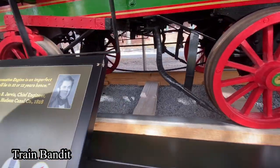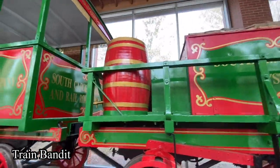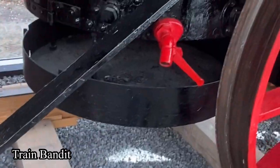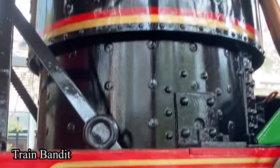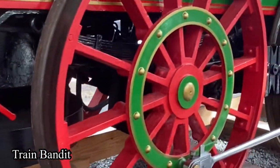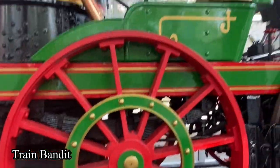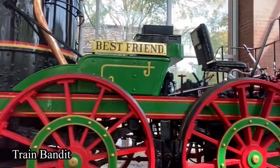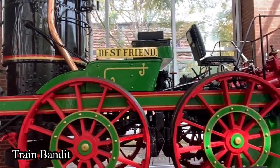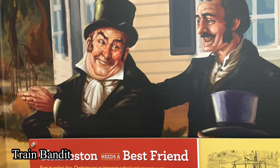So, you might be wondering, why did they do this? Well, you see, you have open-air cars, and you have an ash pan. You burn a wood fire, which boils water, sending steam to the cylinders. That steam has to come back from the cylinders, and to use the steam to its biggest extent, you use it to draft your fire while you're running. Well, you see, that draft is so strong, as with any steam engine, that it blows embers out of the fire and into the open-air passenger cars. And ladies with their long hair would end up with their hair lit on fire, and well, you know, that's not very good for business now, is it?